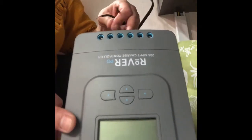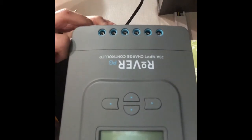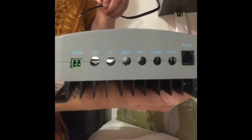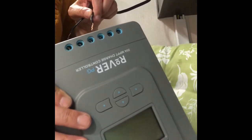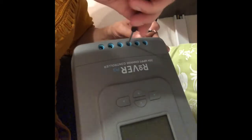I'm going to go ahead and connect the battery to the MPPT controller first, which you should always do. Otherwise if you connect the solar panels first, the energy needs somewhere to go, and if you only connect it to the MPPT first you may damage the controller. So always connect your battery terminals first before connecting the solar panel wires.